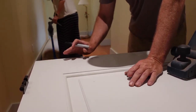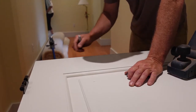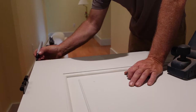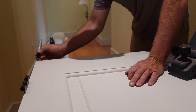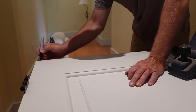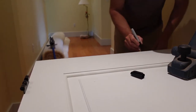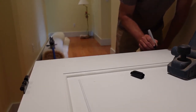Now, one of the ways you can know where you've been is to use a pencil or a straight edge and mark the line right here. I'm going to use a Sharpie. All I'm going to do is just put the Sharpie on the edge — that little width of the Sharpie is about all I'm going to take off. Using my finger as a guide, I'm just trying to get a little line on there so that I know all I'm going to take off is about a sixteenth of an inch. So we're going to make several passes to get to that.